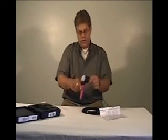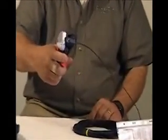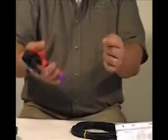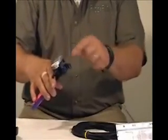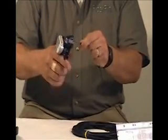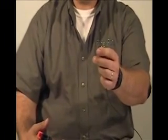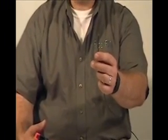Let's go through the process. We insert the fiber into the tool, hold it down, and pull the trigger. Now we have a terminated part. If we'd like to do a strip, go to the front part of the tool. Now we have a terminated fiber stripped to length and ready to be connectorized.